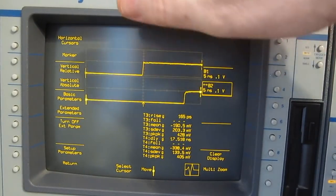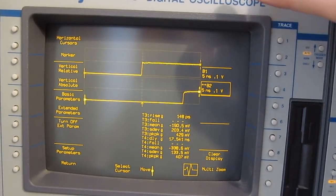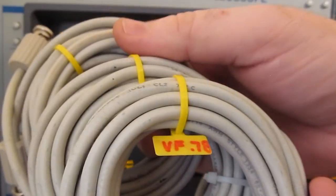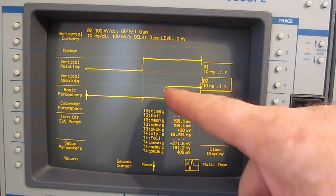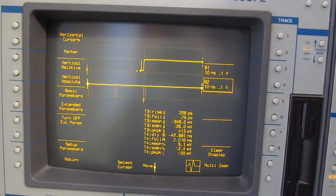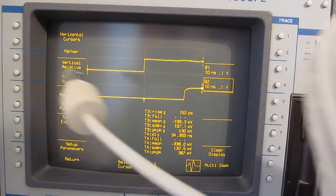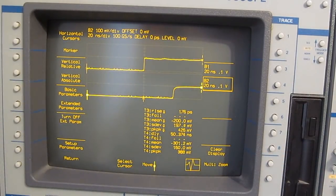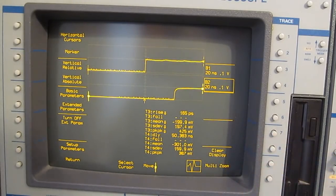That time is going to be based on the speed of light multiplied by the velocity factor for this particular type of coax. Typically, coax will have a velocity factor somewhere between 0.66 and 0.8 or so. Here I have three different pieces of coax, all cut to the same length, with a velocity factor of 0.78. The velocity factor is simply the speed of light multiplied by that factor — it's a percentage of the speed of light in a vacuum. So there's a direct link between the speed of light and how fast that pulse will travel down this cable.